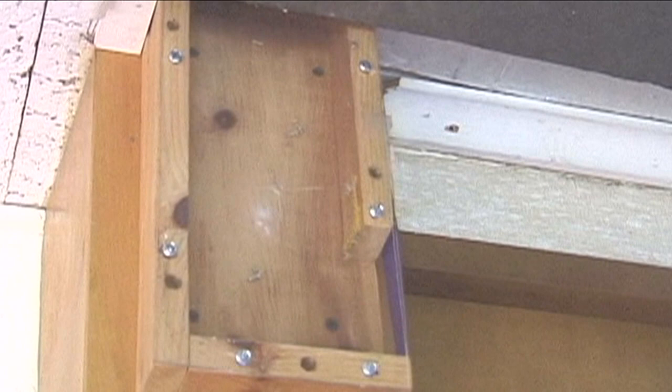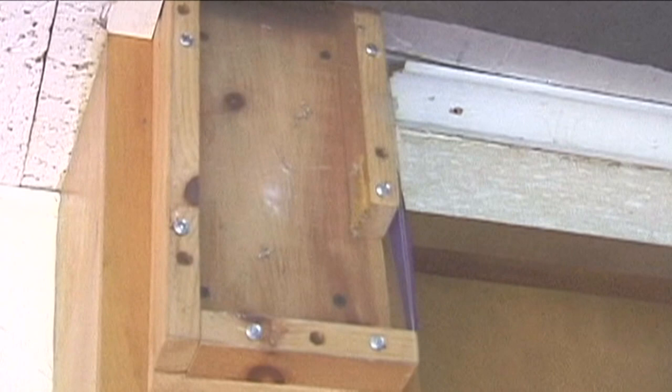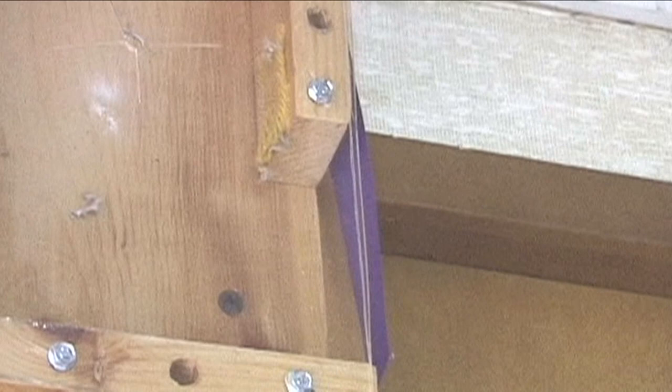Yep. He's going to open the door to the wood stove, and now put on the central vacuum. And look what happened. Now we're pulling air into the house. We've got a reverse flow. Right. And this is what happens if you have all these fans on, sucking air out of the house. You will have backdraft problems on your wood stove or your boiler.